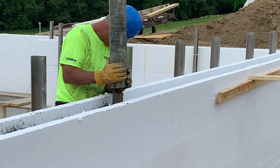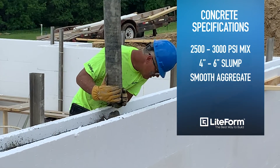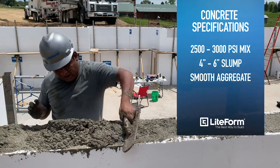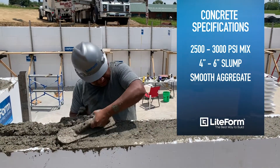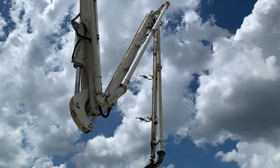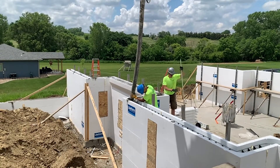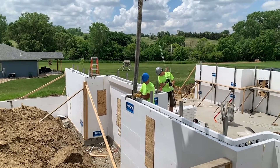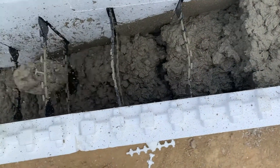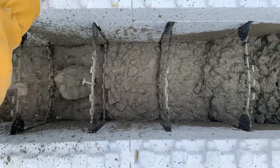For most projects, concrete should be ordered with a design strength of 2500 to 3000 pounds per square inch, usually called a five-bag mix. Smooth aggregate of half inch to three-quarter inch is recommended. Order concrete with a four to six inch slump. Use this simple formula to estimate how much concrete you'll need. Concrete is typically placed with a concrete pump. To minimize the risk of form failure, the discharge pressure from the pump should be reduced with double 90-degree elbows, a hose reducer, or a hose harness. Move around the form filling it in four-foot lifts or layers. In about 30 minutes, the concrete will support its own weight and another layer can be placed. For best results, place a maximum of two lifts per hour.